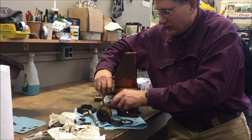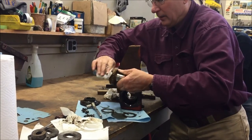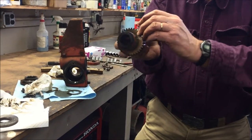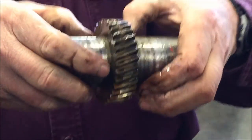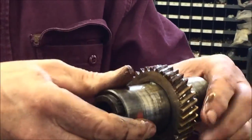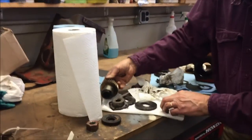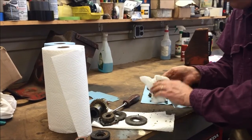Some of the older ones will have one on this side and a thrust bearing, which is two little thrust washers with a radial bearing. And there's the money — here's the gold. Now this gear is actually in very nice shape; you'll see a little bit of wear. This is the side that's got the wear — the worm gear literally pushes the gear forward. This is sort of off-centered; this side is longer than the other. That's critical when you put it back together again. There's just a key in the middle of it, held on by the thrust washers. So that's the $150 gear? This little thing, yeah. And I'll show you one later — if you don't have the right lube in there, what they can look like.